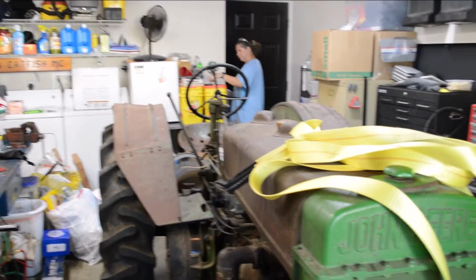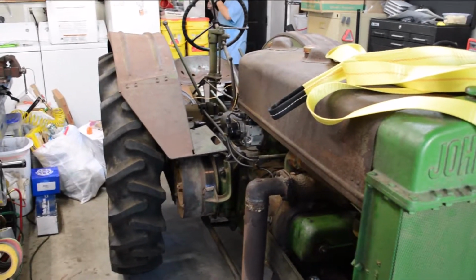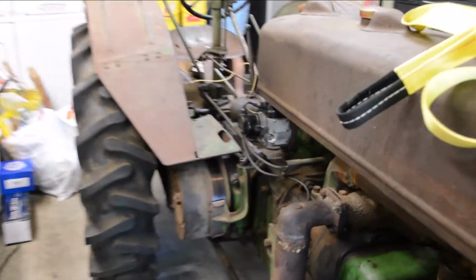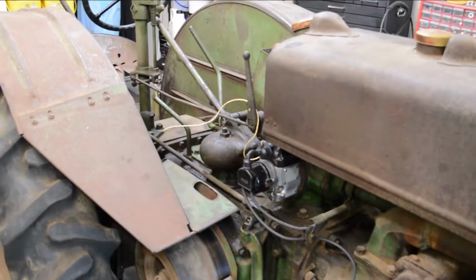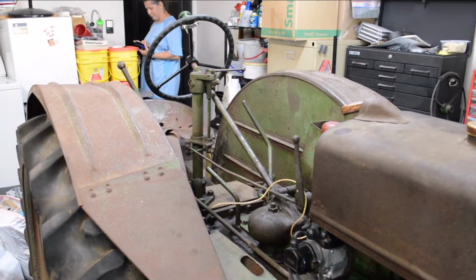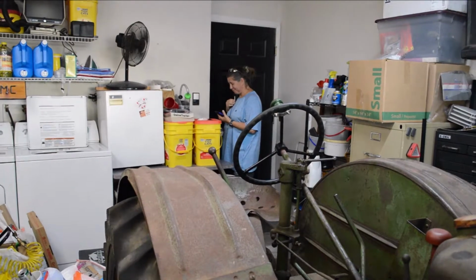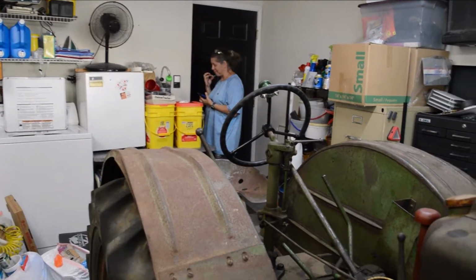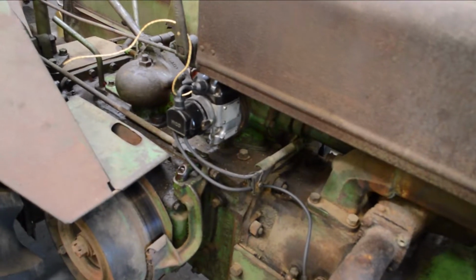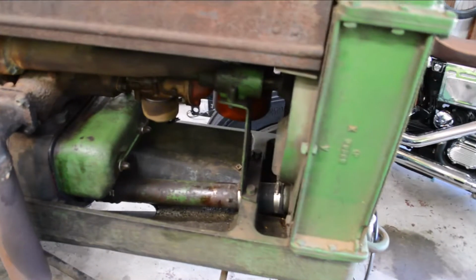All right, so we couldn't get the thing started. I think the mag is too weak, which is an issue that I knew I had when I got it, so that's the next step. Did learn a few things. Got good oil pressure, was able to loosen up the tranny, and the motor feels freer. Got it drug around the apartment complex a little bit, thanks to my lovely assistant. Thank you, Roberta. So I'll wait till we get a new mag and we'll try it again. I think it'll run. Nothing seems to be leaking, so that's good. I learned a few things, so one step closer.